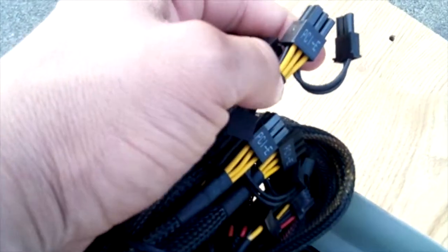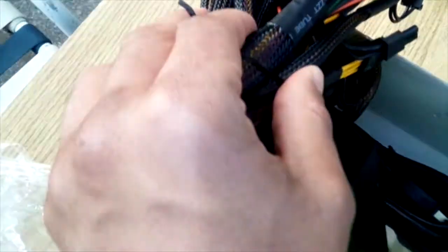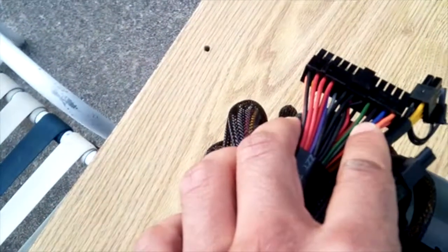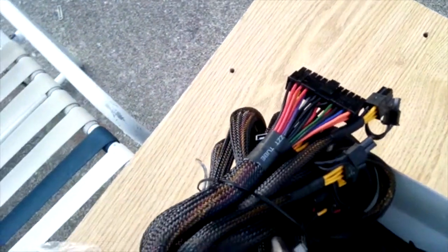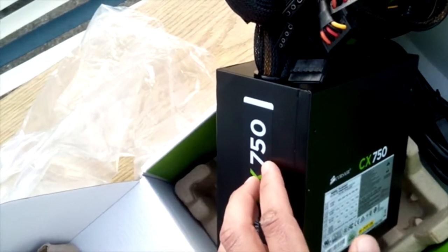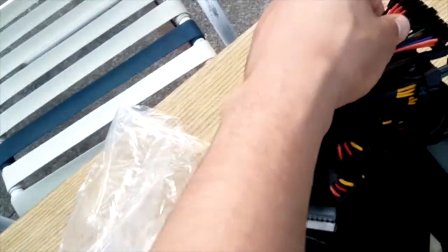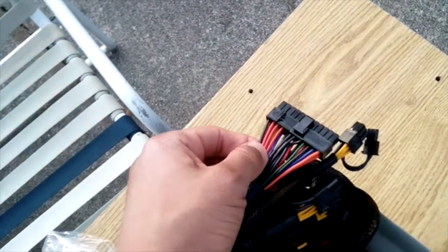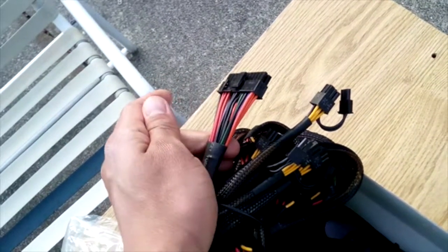We're actually just looking for the yellow ones, which are the 12-volt power that we use to power the amplifier, like a car battery. All these yellows in here — that's what we're looking for. The black is ground, and then we have the green cable, which tells it to be on or not. I'll publish something related to converting power supplies into lab power supplies.